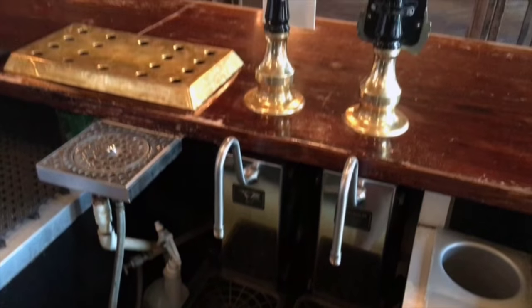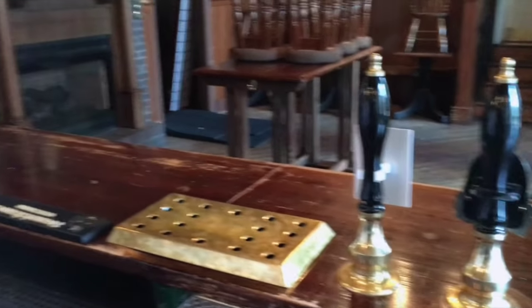It's very important to use an external pump. If you use a submersible pump, the action of the pump will actually heat the water up and you'll find that you'll be heating the beer instead of cooling it. In this setup, we also use the cask wedge system, which gives you the ability to dispense the cask in an upright position. Most keg coolers are a little tight to fit casks horizontally, so the cask wedge system works perfectly.